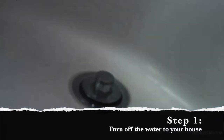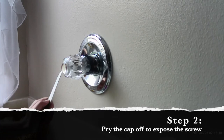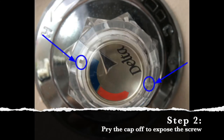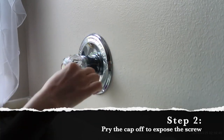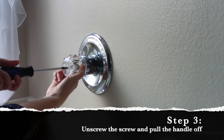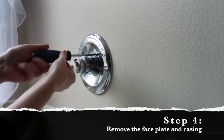Before you start working in your bathtub, make sure that you either close your drain or put something over top of it so nothing falls down there. In order to take off the handle, you're going to have to get access to the little screw that's underneath the cap. Here's a close-up of the bathtub handle — I'm just sticking a pokey object into these two little notches to pry that little cap off. It can be a little stubborn so keep prying a little bit at a time until it pops off. Next you need to untwist that screw so that you can get the handle off, then just grab the handle and pull it right off.